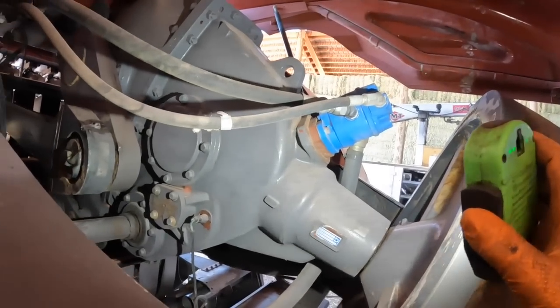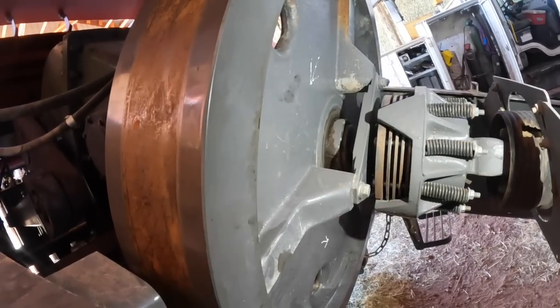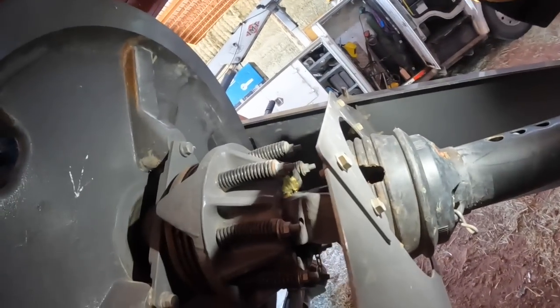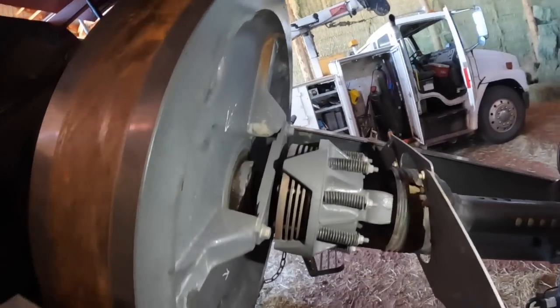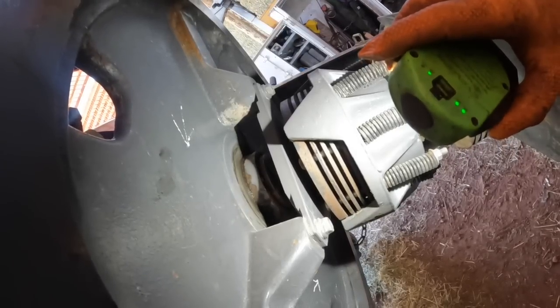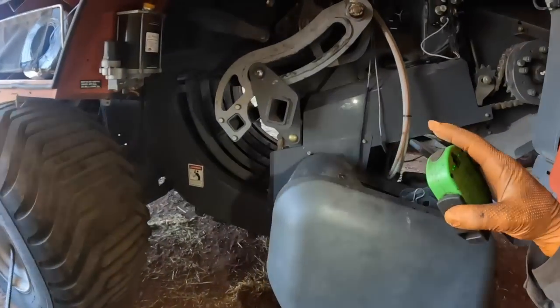Somebody's put a hydraulic pump in the steering gear box. And it's probably a good idea to slip the clutches. They tell you to slip these clutches. What happens, the rust gets on them. And what you can do is start the baler and just put it at a idle there and kick the PTO on, then just get out and grab the brake and just pull the brake on it and slip that clutch. It's called burnishing the clutches is what it is. So it's probably a good idea to do that, because what happens is these clutches will rust on you sitting all winter, and then it won't release, it won't slip. The rust will hold it together, and then it'll just tear the living shit out of everything when it won't slip. It'll tear the drive lines out of it, or tear the gearbox up in the baler, or, you know.